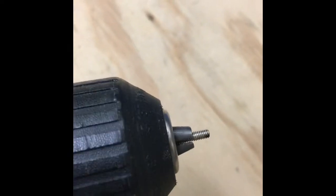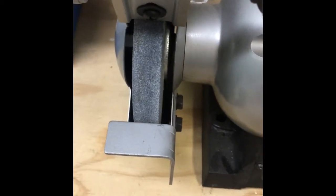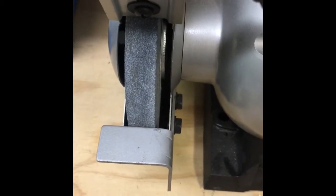Put it carefully into a drill chuck — you don't have to put it in too tight, it won't ruin the threads. You're going to rotate it while it's being ground on a bench grinder. A bench grinder is something you'll definitely need — they're cheap, most of you probably have one, and if not you can pick one up at Home Depot. Always handy to have in your workshop. So we'll fire it up and go straight in while rotating.